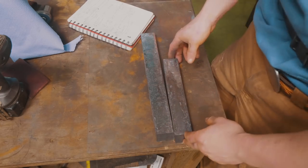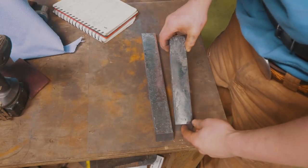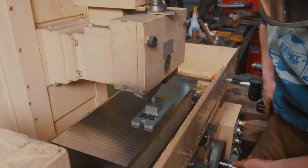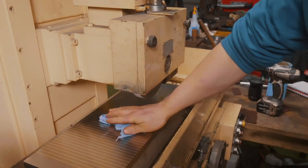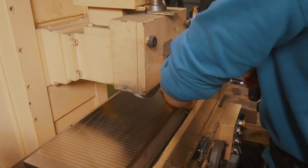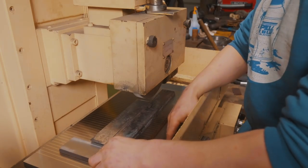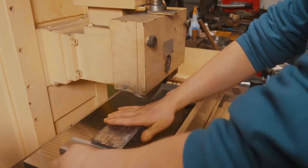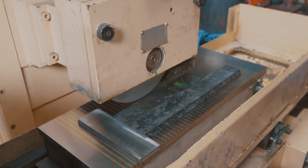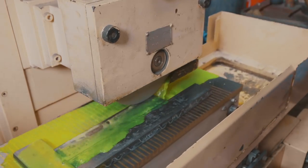I've cut these pieces at a place where it's going to divide evenly with the 16mm long cuts I'm going to make. I've ground off the scale with an angle grinder. I'm going to true my wheel with a diamond here at the surface grinder, wipe down the chuck — I've been keeping a covering of light oil on it. Wipe it down, dry it off, and put some oil on it. I'm going to wipe that off, then gently set our material on. This will hopefully add a little bit of surface area to the grip of the magnet. Turn on the magnet, make sure everything feels secure. I'll adjust my stops, on we go with the wheel, and let's start grinding. I'm going to take a skim across the whole thing in case there are bits that are really out of flat.